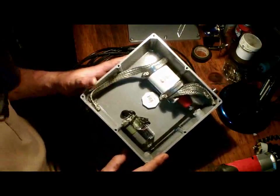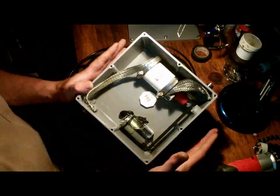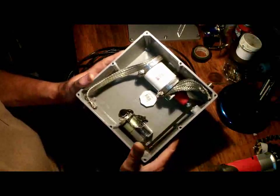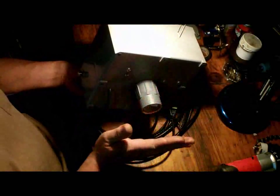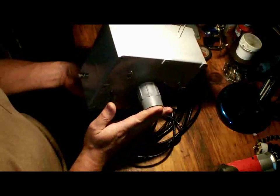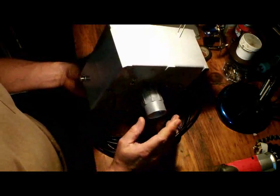Resistance is a killer in magnetic loops. The control box is basically an 8-inch electrical box, and everything I have is mounted on 1-inch PVC. There's a 1-inch PVC coupler on the bottom that goes onto what I call a 'toiletator' — a 12-volt DC antenna rotator — so I can turn the loop remotely, because these antennas are directional.